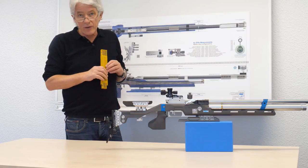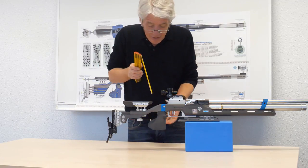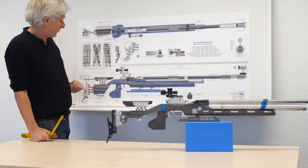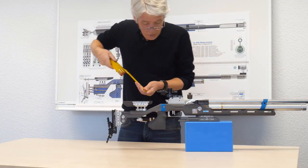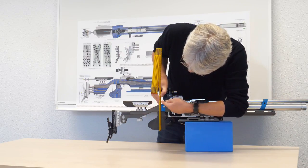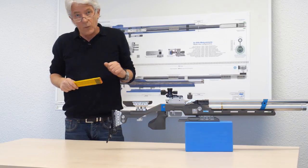When we want to control the dimensions of our air rifle, we can take the measurements from our list or from the rulebook and then measure in reality. For example, the lowest point of the grip — we find here in the drawing — can be 16 centimeters or 160 millimeters. So we take our ruler, go to our rifle, go to the lowest point of the grip, and then we look for where the centerline of the barrel is. At the moment this seems to be something like 15 centimeters. This is one way, and it is a little bit complicated if we want to measure everything.